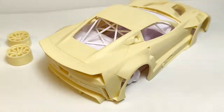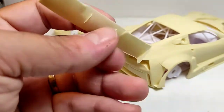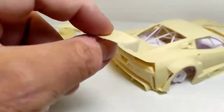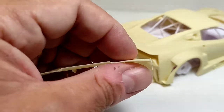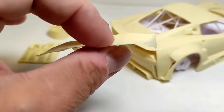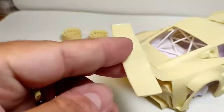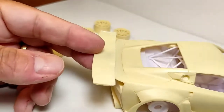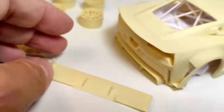Because of this thinness, I had a problem during casting: the side fins were too thin to survive the molding process. Nearly all molds came out without the other fin molded — it broke off. I made it in real aluminium and it was already a miracle to have even one survive. They're extremely fragile — I think just posting them they would break. Also, the rear wing mountings are not included, which is a minus. However, with the detailed pictures of this car that I can provide, I think it's absolutely easy to scratch-build the wings from thin plastic or metal.